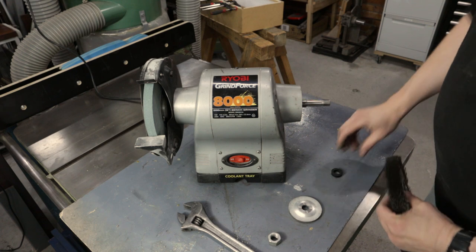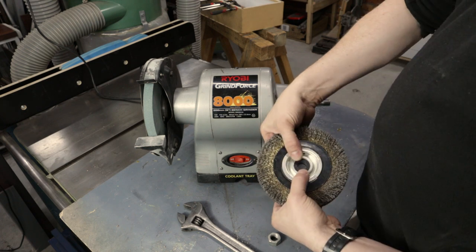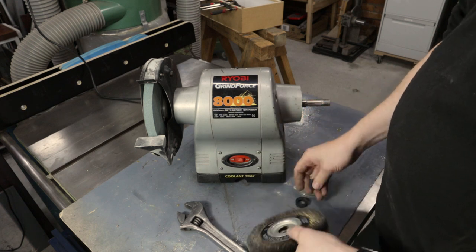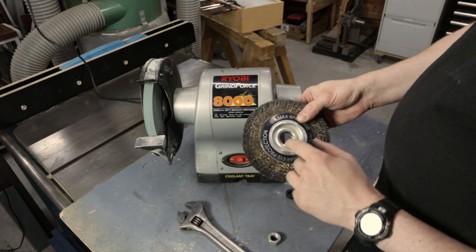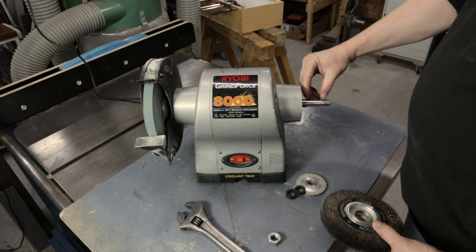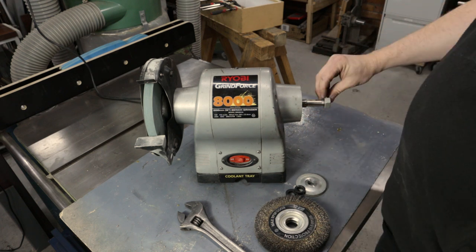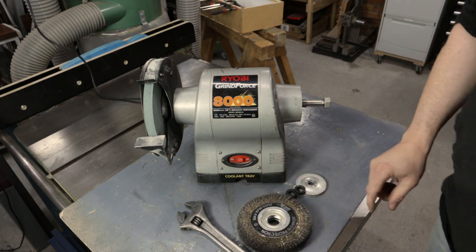What I want to do is come up with a device that clamps this interior on a larger surface area than just that rim. Hopefully it would fill this area, if that's concentric, and it would negate that dent there by spreading out the load on the whole surface. Reduce this down so that it fits on the shaft, and also uses up as much shaft width as possible so that I've got full engagement of this nut. So I need to take that measurement when that's fully on there. You take that measurement and some measurements from this and come up with a little design. I'll get back to you in a few minutes.